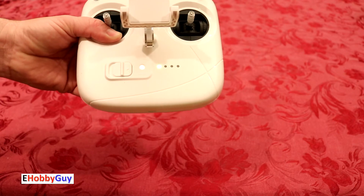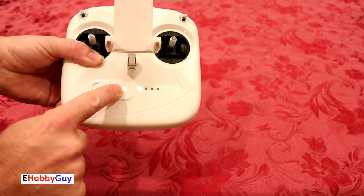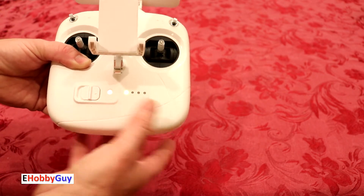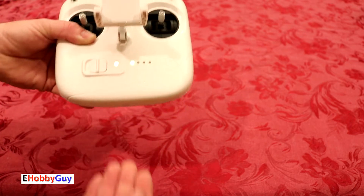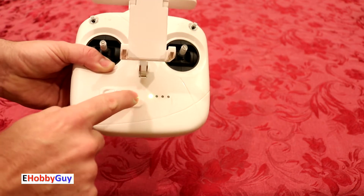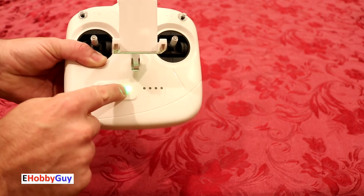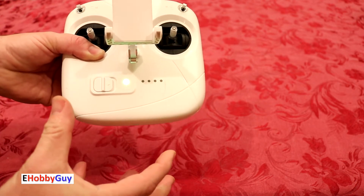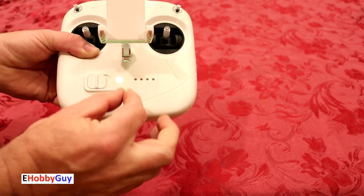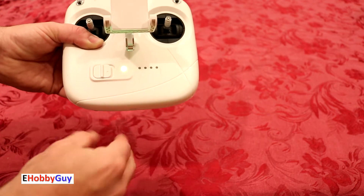When I push it into the on position I get into on mode. This goes red because it's less than 100%, and there are four LEDs indicating 25, 50, 75, and 100 percent of charge. When I plug the charger in these all light up, and when it's fully charged this turns from red to green. When I turn it to the off position that should go off — and it is not going off. It's staying on and slowly draining the battery. Something went wrong when I opened it up and unplugged a cable from the motherboard — I did some damage.